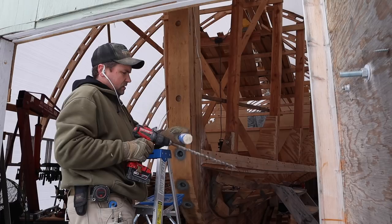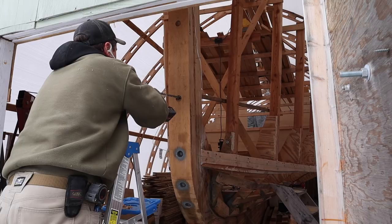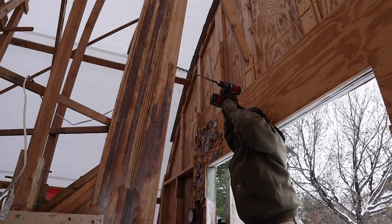The planking process is going to put a lot of stress on our laminated white oak stem, so I wanted to get some through bolts installed there. These are just galvanized 5/8 inch, 12 inch long bolts. We were careful to install some caulking cotton underneath the heads of the washers to keep water out.